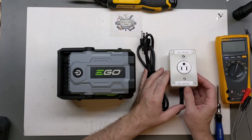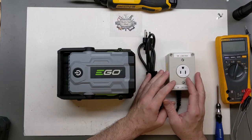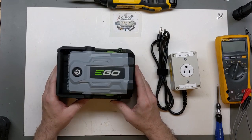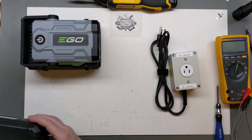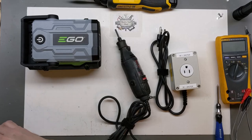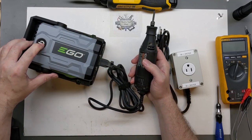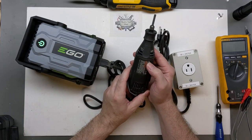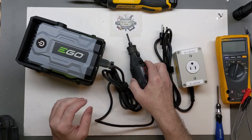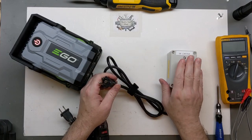Today on the bench I wanted to take a quick look at the little 5R limiter, the little NTC limiter. In my previous video I was talking about my EGO chainsaw and how well it had done, and I briefly talked about the Nexus Escape 150-watt inverter and how it wouldn't actually run my chainsaw sharpening Dremel. I had this small Dremel and simply tried to hook it up with the Nexus Escape. Even though this is a 1.15-rated rotary tool, it's just too much inrush current and it faults it out. I mentioned in that video I had a 5R limiter.